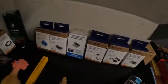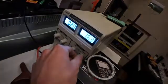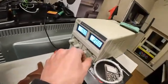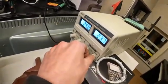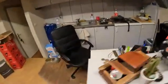This is a temperature and humidity sensor. These are the LEDs. So it strips like this. Just 2 wires, and here you have a lab power supply. So you see, if I dim the lights at 16 volts, I could make them work, but then they're not so bright. So if you power it up a bit, you can see it gives off a lot of light. Now we're just at 20, so if you go to where it should be, 24, then it's very bright in here. And this will be on the scooter the same brightness, but then RGB color.